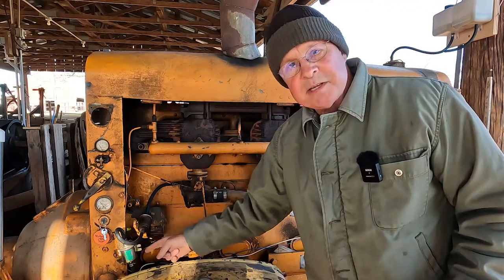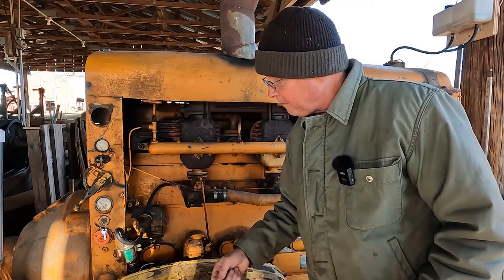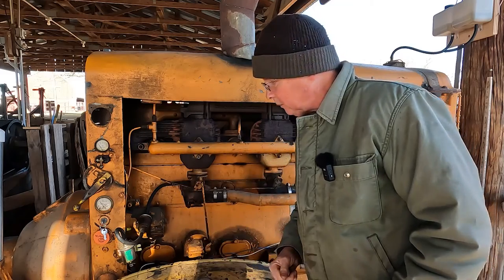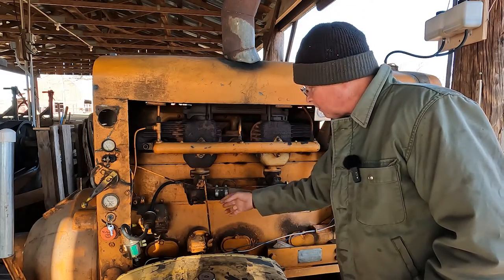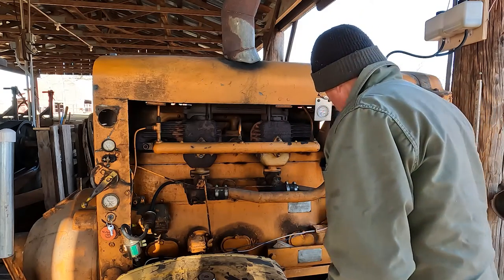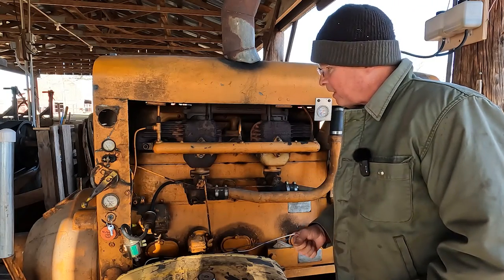Things are pretty straightforward on this side. We have a little electric fuel pump - this is not gravity feed anymore. Fuel filter, we replace it every once in a while. Pete knows where to get a fuel pump that works. We put some new hoses on it here because these hoses were all dry rotted. It's a dual carburetor system - puts out about 100 horsepower. Pete fixed the alternator for us, and I put a temperature gauge on it.